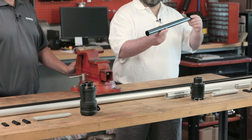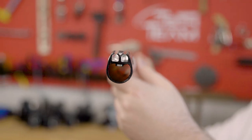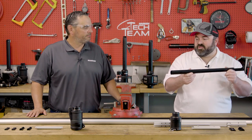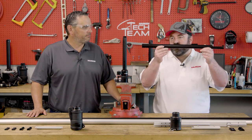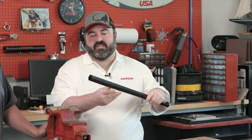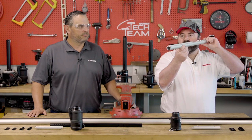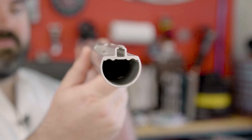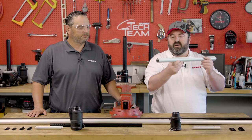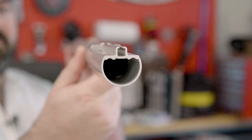The first foil is the Mark IV. It is a double groove foil which makes it easier for use in racing so you can raise and lower different jibs and do some jib changes. One of the changes we've made on the Mark IV line recently is we've changed all the foils to black. In comparison, the Mark IV Ocean line has a single groove because cruisers don't necessarily always want to change their jibs while sailing. It goes up once and probably stays there for a long time, and they also have a round foil shape which gives a nicer furling aspect for those big cruising jibs.